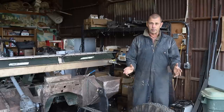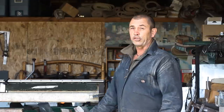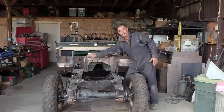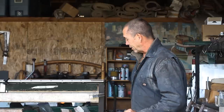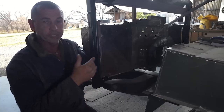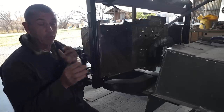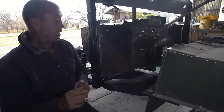Now we're going to look at the foot wells. As discussed in a previous episode, the extensive modifications necessary to allow fitment of the V8 engine explains why we're trying to restore these original foot wells rather than replace them with new ones, and hopefully bypass the need of recreating the entire central area that goes over your bell housing. When we ripped this apart from its original bulkhead position, there's no doubt been a little bit of stress that's created a slight wonkiness to it — and also 70 years of rust and wear. So you can see this lip is not lining up with the door pillar post in a relaxed position. With a measure of force I can heave it back and we could probably weld it into place, but I don't want to force the metal into a position it's not comfortable with, for fear that when we take it out of the jig the whole bulkhead will go.